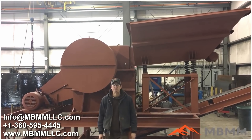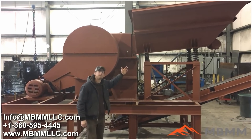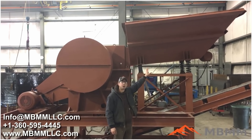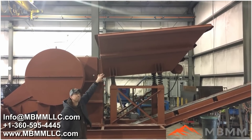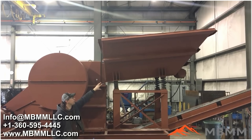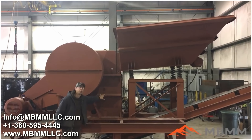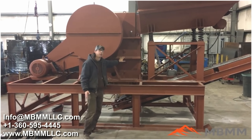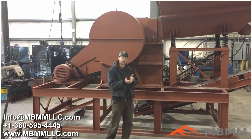My name is Jason with Mount Baker Mining and Metals and today we're going to do a demonstration of our 16 by 24 Jaw Crusher module. The first stage is the hopper here — this is a custom eight-foot long hopper instead of our normal seven-foot long hopper. It can accommodate a full eight-foot wide bucket so you can dump your whole bucket in at once. The hopper vibrates the rock and material down into the Jaw Crusher. This is a 15 to 60 ton an hour machine depending on the jaw gap, and right now it's set for about one inch minus, so it'll do about 15 tons an hour.